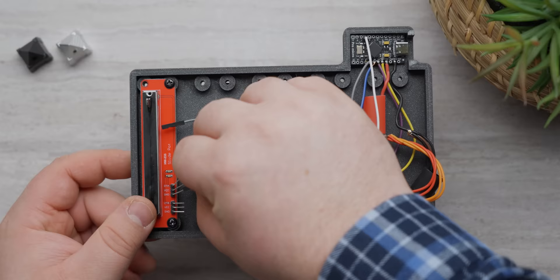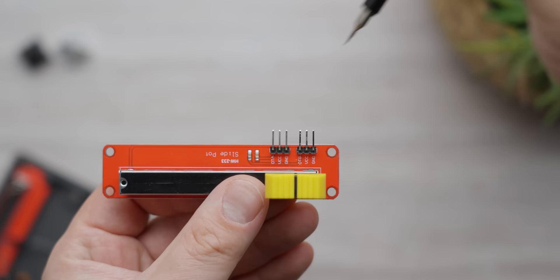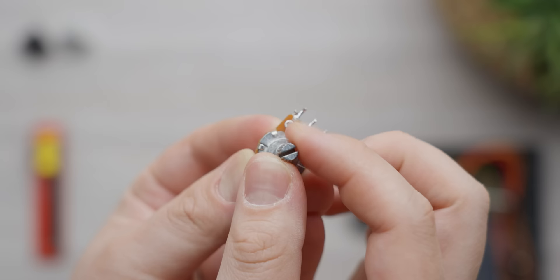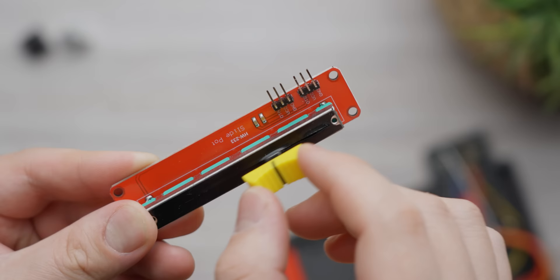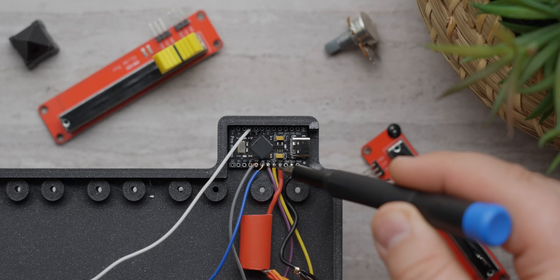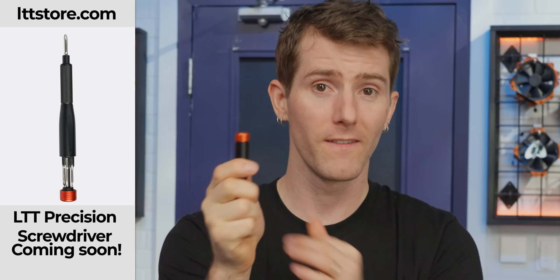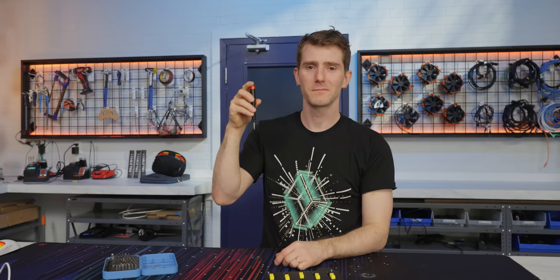Hardware-wise, it is surprisingly simple. Each of our potentiometers gets wired up to common ground and to a power pin, and then that third connector — the wiper — is going to be doing the bulk of our heavy lifting. A potentiometer is effectively a user-adjustable resistor, and the position of the wiper determines the resistance. Each of our wipers gets connected to an individual analog input on the controller, and once everything's wired up, we can close up our enclosure with the new LTT Precision screwdriver and put on our knobs. Sign up on LTTstore.com for an in-stock notification — we are very excited about this thing.